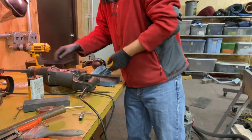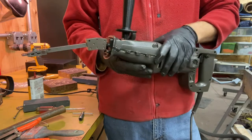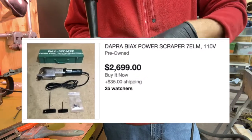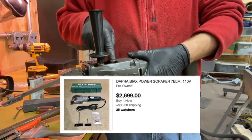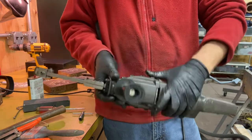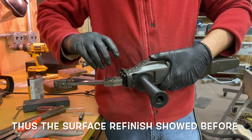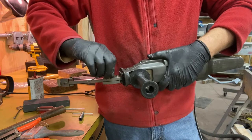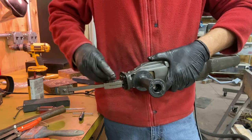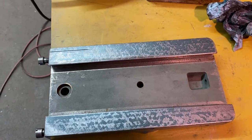I found that my DIY scraper was making too long a stroke, so I shortened it up. Unfortunately, unlike a proper Biax where you just put a screwdriver in and dial it off, I have to take my thing apart to get down to that scotch yoke and change the stroke length. I have a whole other video about the making of this that explains all that. The screws had rusted in, so it took about an hour to get it all taken apart — kind of frustrating. It's satisfying to use your own tools, but on the other hand you kind of wish it was just plug and play. I wish Biaxes were affordable.